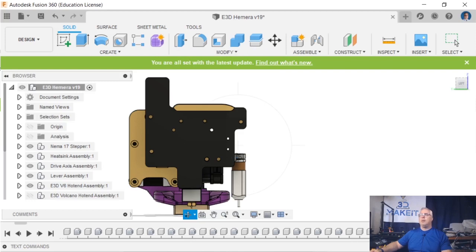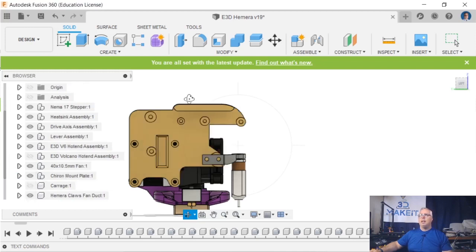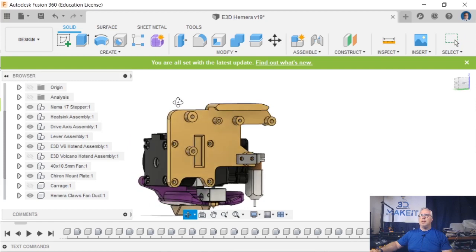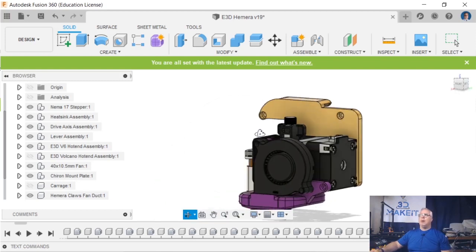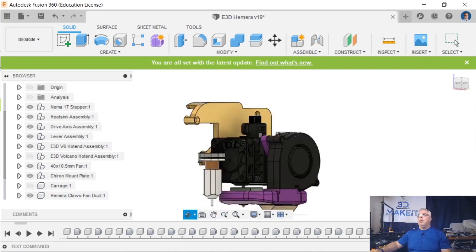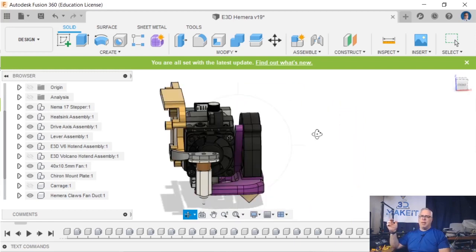On the back, this is what I do all my designing on my Chiron. I've made a bracket that I can design off of, which has all the same holes that come from the factory, so I can quickly modify my design and iterate on it. The E3D's thermistor has a clip, so this little slot in the back of the mount is so the wiring comes up the back through the mount — so it's fairly neat — and the only wires that come off of this are the extruder wire and the one fan wire up here.